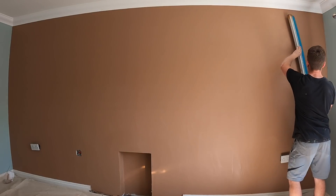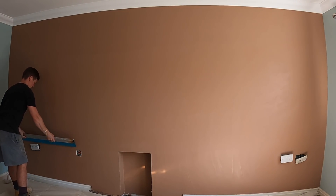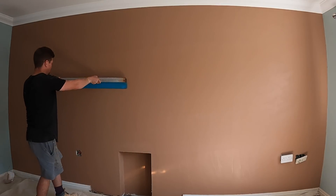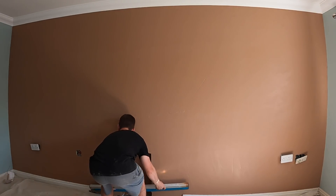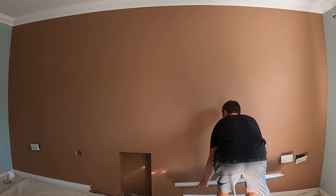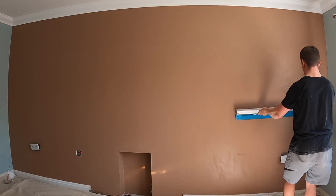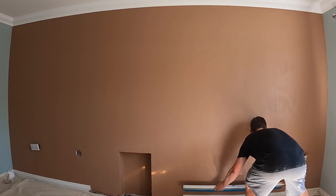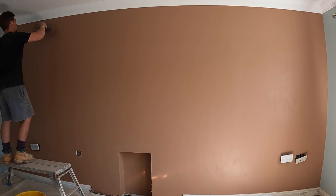That was a very good point — always look down your wall. I can't emphasize enough how much spatulas have changed my plastering in terms of flatness and general wear and tear on my body. The OX Speed Skim is an absolute game changer — if you haven't got one, give it some thought. Getting your wall flat as early as possible: a good finish in plastering is probably 50%, maybe even 70%, down to how flat your wall is, because plaster can be filled but it can never be re-flattened once it's done.